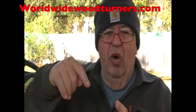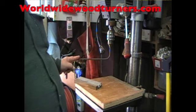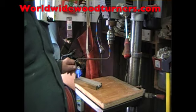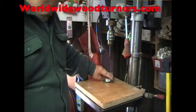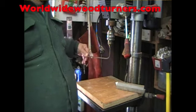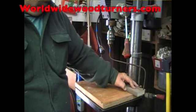All right, now, we're going to swing it to one side. Then swing it to the corner, swing it back. Now, it should be the same distance off the bed at all 4 points. You can use a feeler gauge. You don't do the points in your car anymore, so you've got an old feeler gauge. You can use a block of 1/4-inch steel if you want, but you use the same piece on all 4 corners to measure. All you're doing is gauging that bar.